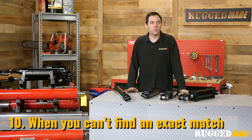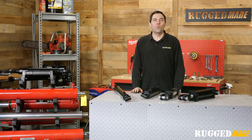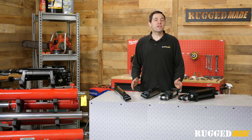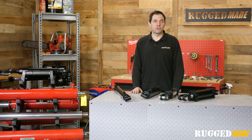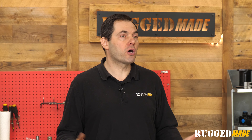You may find a cylinder that is almost perfect — maybe there's a dimension that is just a little bit different than the original. A cylinder that is not an exact match will often work just fine, and this can save a lot of money compared to buying an OEM cylinder. When it comes to the stroke, you do need to be careful. If the replacement cylinder has a longer stroke than the original, make sure you will not be overextending a part of the machine in a way that could damage it or interfere with another part. For example, on a log splitter, you wouldn't want to use a 26 inch stroke cylinder on a beam meant for a 24 inch stroke — that would allow you to push the blade right into the foot. On a tractor, maybe all that happens with a longer stroke is the bucket curls a bit more and it doesn't cause any issues. On the other hand, a shorter stroke would mean less throw than the original, but that might not affect operation either.